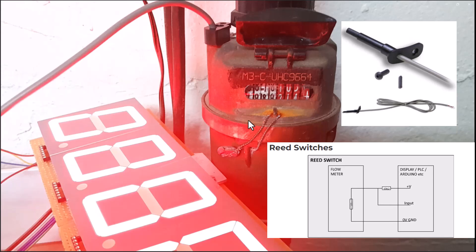The rate of the pulses coming out will be proportional to how the water is flowing. If the water is flowing fast, you'll have more pulses, and the counting is incremented per liter. You can see the red numbers here are basically the hundreds of liters and the white ones are the kiloliters — that's basically how these water meters function.